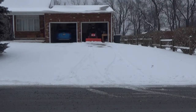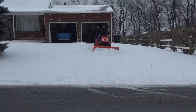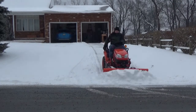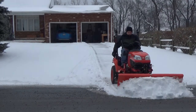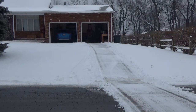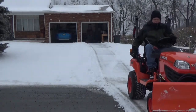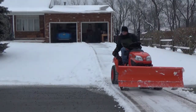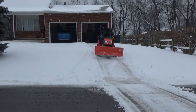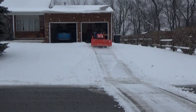Okay, we're going to go ahead and get plowing. As I'm plowing, the first thing to mention is that I'm keeping the blade primarily in a straight position as much as possible. Since I'm coming out of one bay of my garage I'm not in the center of my driveway, but I typically do that as my first pass just to make cleanup a little bit easier. Also, I didn't just hop on this tractor without allowing it to warm up — check your Kubota owner's manual to see how long the tractor should be warmed up based on the outdoor temperature.